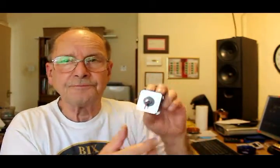It's very common for a stepper motor to have 200 steps for one revolution, and this motor is like that — that's 1.8 degrees per step, and 200 steps will take it around once. In my application, one of the speeds I wanted was about one revolution per second, so if there are 200 steps, we need to feed 200 pulses per second into the driver, and with any luck it will rotate once a second.